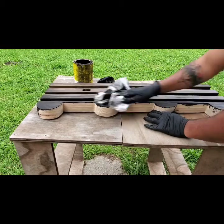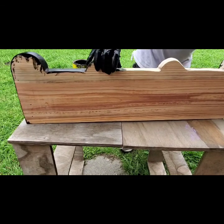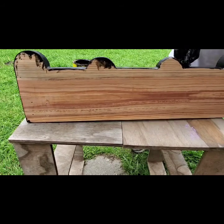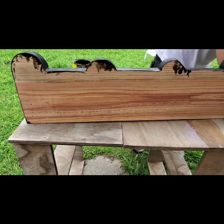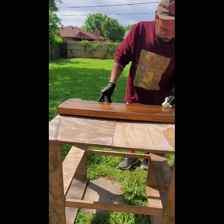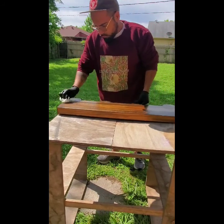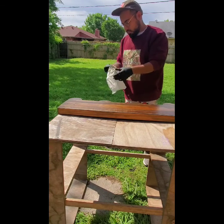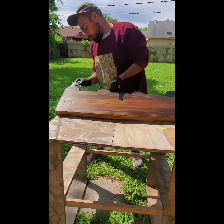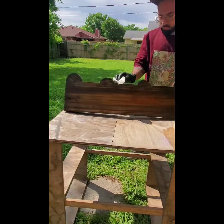Now that it's all finished, we're going to go ahead and use this black charcoal. I've really liked the way it turned out on the pine wood, so I'll be using it more. All I'm doing is soaking it in and then coming back with a dry cloth and wiping it off. The next step is to apply a finish — I really like the linseed oil I've used before; it's a clear finish, nothing glossy, no shine, and that's what I'm looking for. You apply a good amount, let it sit for 20 minutes, then come back with a dry cloth and wipe off all the excess.